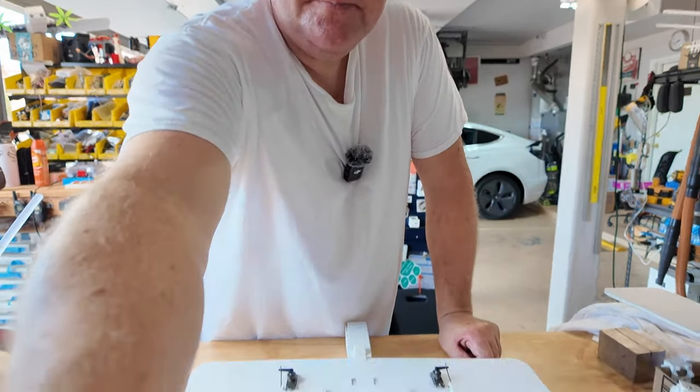Slide the motor into its final position, which is flush like that. And at this point, I'll put a little bit of hot glue just in here. You're really just holding this motor in alignment, so you don't need a whole ton. The motor's a pusher. It's always pushing itself harder into the airframe. So again, everything just kind of lines up and your wiring goes through.